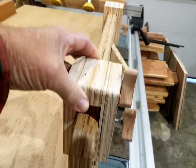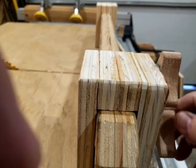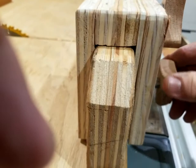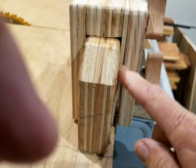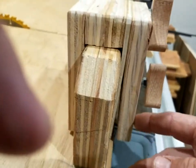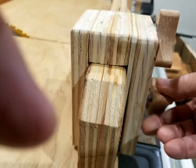What happens with this is there's not enough support, even with this one-inch block in here — maybe if they were taller. What this does is it pushes out. There's a bolt inside here and it pushes this piece of quarter-inch plywood up against the fence and it locks it. The only problem is this is pushing this away, so I'm going to put a cap up here — plywood locked in with some Baltic birch — so that this doesn't flex, but it will still flex in and out and make a shim for it to fit.